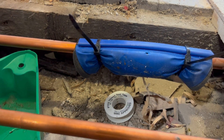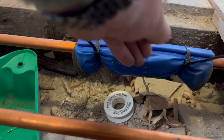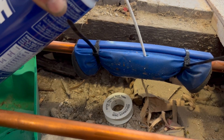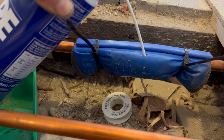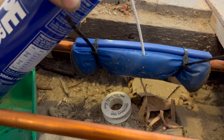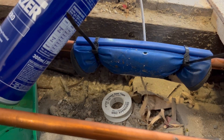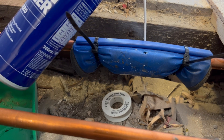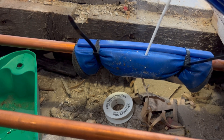The zip ties are nice and tight. You can see the little hole in the top — that's where you insert the can nozzle. I've got just over half a can left. Keep spraying in for about 30 seconds. As long as you don't see liquid coming out where the spray nozzle is, you're fine. If CO2 liquid starts dripping out of both ends, stop for a minute, then move the nozzle around to get it into a different part between the two clips. Shake the can a bit to check how much is left — I always like to leave a bit in the can.